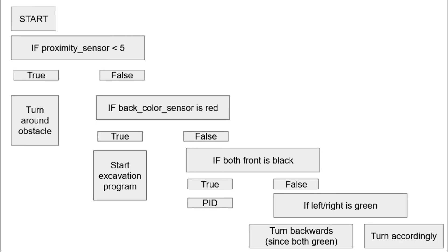While the robot runs outside of the collection area, it will check for the color green near the line and turn accordingly depending on whether it is positioned on the left or the right. If the robot sees two greens at once, it will come to a stop and make a 180-degree turn to face the other direction. If the robot doesn't see any lines for a short time, it will speed up and move forward until it finds a new line and then continue its line tracing.